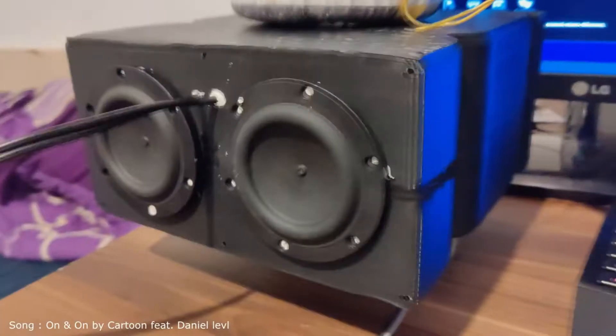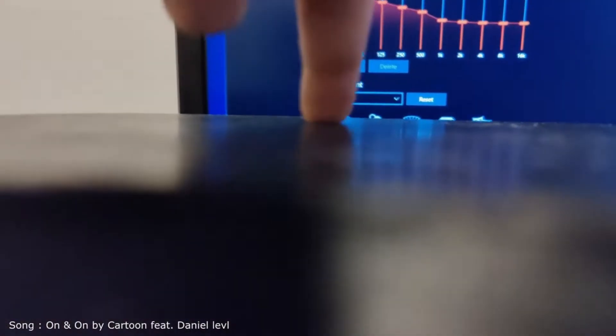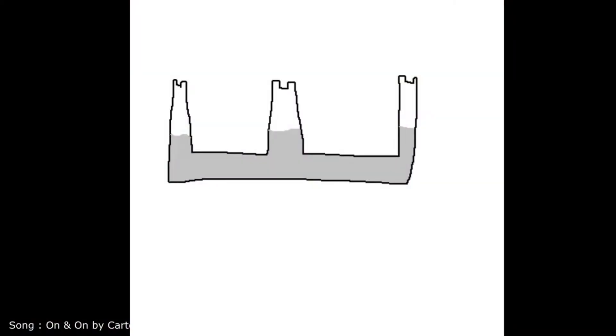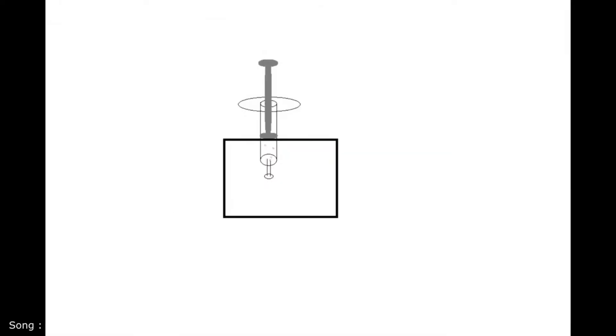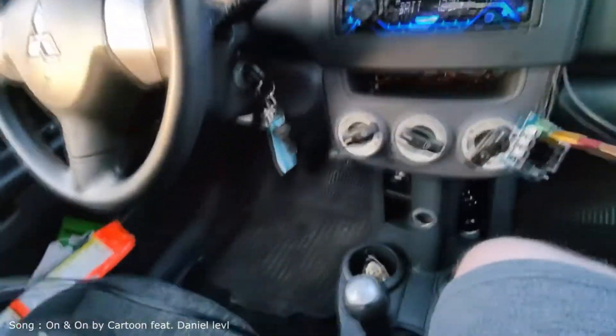Right around the corner the next problem appeared. Not speaking about the huffing noise — that's just a leak on the speaker — but the sides were loose enough to shake due to the print problems in the beginning, and that's what you're hearing. I had an idea how to fix that: I bought resin, which was funnily enough more expensive than the plastic needed to print the box itself. I filled up the whole box through the hole you could see there, and you know what they say about warning labels — the stuff is rock solid, the box is really heavy now, and it sounds really great.